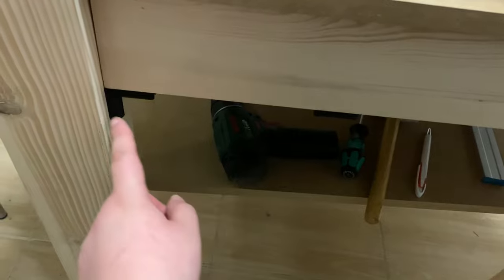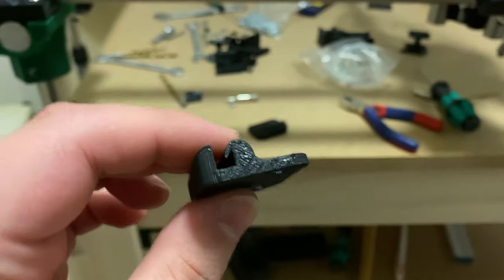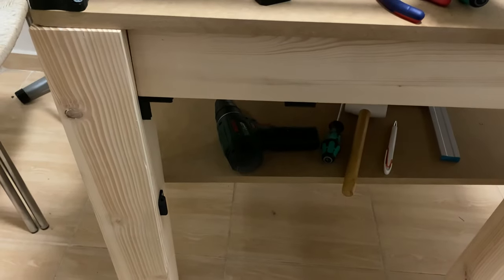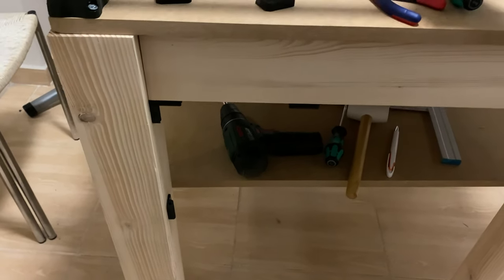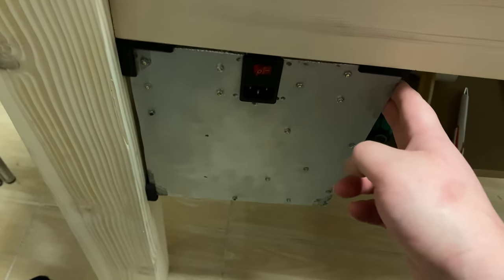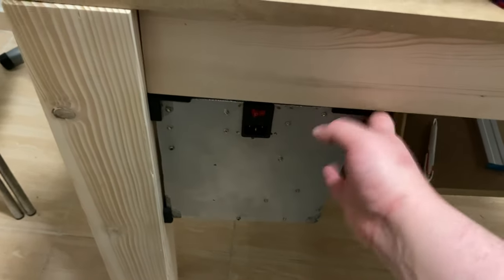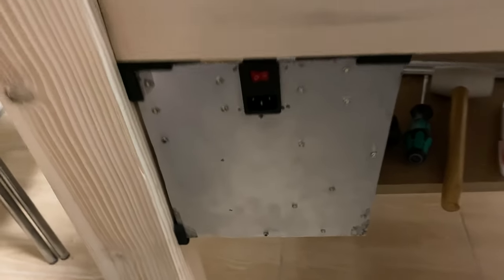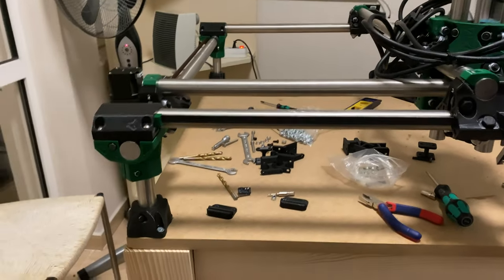Here's the solution I came up with — it's a four-piece design, two mirrored pairs. It's a tool-less design that uses a plastic spring to compress the plate in place. It does require two hands to operate. The plate is nicely secured and doesn't wobble much — it's actually a little tighter than ideal and not the easiest to remove, but that's also a plus since it won't come out on its own even with the machine running.